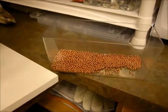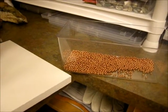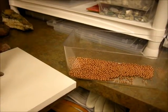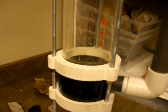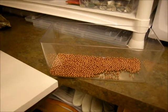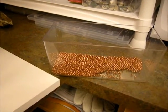The copper-coated steel shot I was using — I found rust almost instantly after putting it in water, even though it's copper coated. So I've ordered some brass shot to go in the jig bed. I decided to go with brass because brass has a specific gravity slightly heavier than steel, which should help keep the black sands above the shot.